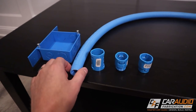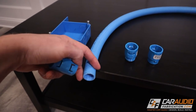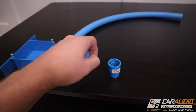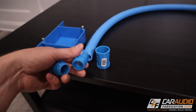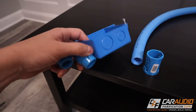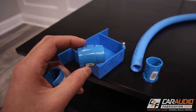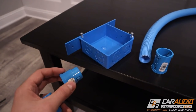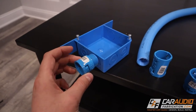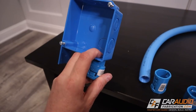As far as the different connectors go on ENT tubing, you have couplers, which are used if you make one cut short and need to attach two different pieces together. You also have these style connectors where one end the conduit pushes into, and you knock out the knockouts on the ENT box to push through. I actually don't like that style as much because if you need to pop it out for any reason it's super hard. I prefer these threaded ones that use a typical metal conduit locking nut to lock them on.